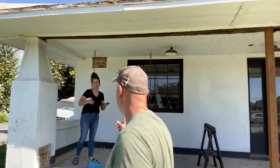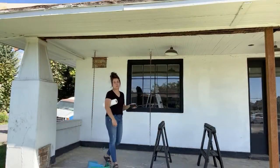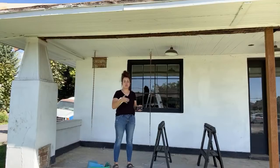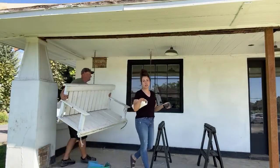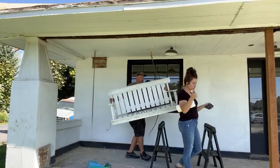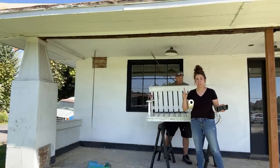Lynn, if you're going to be using milk paint, definitely make sure that the undercoat is all the same color, so when it chips through, it's good. I like to use Dark and Decrepit, sorry, not Big Top, because it has a built-in sealer, and then let that dry all the way, and usually it won't chip through that. Usually.